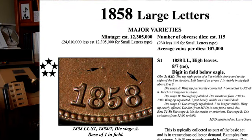Another thing you can identify this die with is a little die dot that's above the first 8, between the 8 and the eagle. This is actually a misplaced digit — it's a corner of a one digit, so it looks kind of triangular. What misplaced digits are is an ad hoc way of testing the hardness of the die. They take a digit punch and tap it into the die, and if it makes a mark, it's soft and they can work on it. If no mark is made, then the die is ready for striking coins.